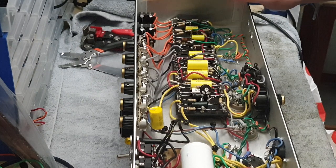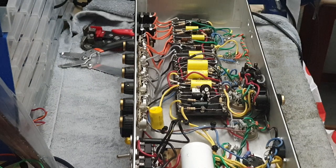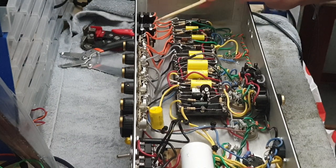These will move onto the jacks. And it'll free up these turrets on the board here for me to use for other purposes, like setting up a separate cathode resistor for the other side of this, and also a voltage divider between the two gain stages, because in the 800 preamp, of course, I'm going to cascade the output of V1A into V1B.